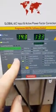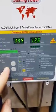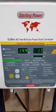So let's just pick Sealed Lead Acid, and then once you've selected the one you want, just press the Enter button again and the PCU shall reboot with the new setting.